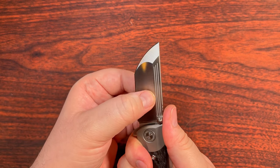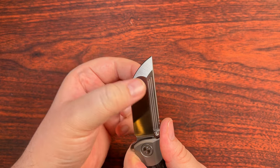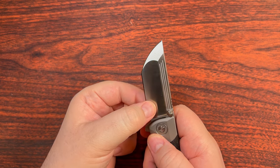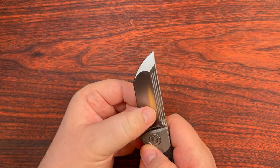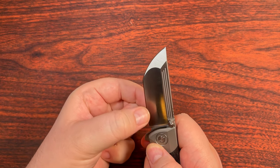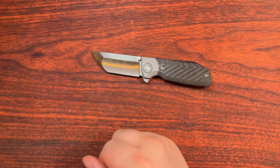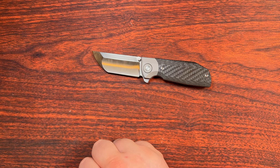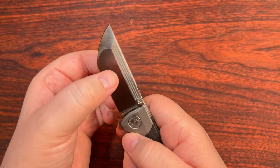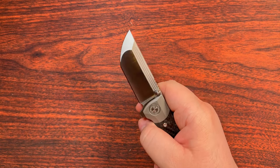This thing is really, really nicely hollow ground on the standard flat portion of the blade — it is Tucson's standard hollow grind. So it is still a little robust behind the edge; it doesn't come down quite as thin as some of their full flat grinds do. So it's still robust, but still has a lot of extra blade material removed to reduce friction.